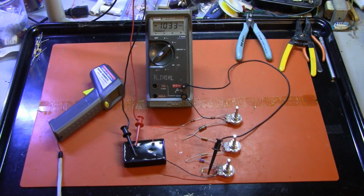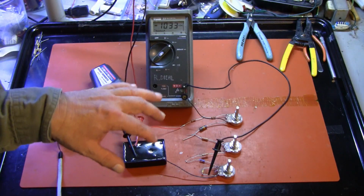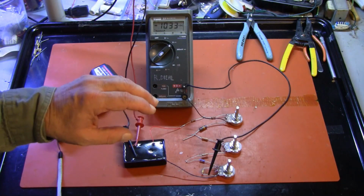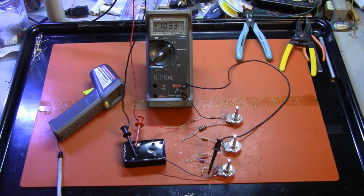Now, as I said, the tube elements add no load to the resistor string, so this is a valid test. The number of microamps that will be pulled by the tube, by the electron beam in the tube, are insignificant. And even if they have a small effect, we adjust the voltage of the low voltage power supply to compensate for that. So this is the DC bias string for the 2F21 monoscope tube in the Chief.